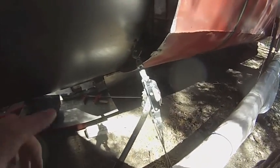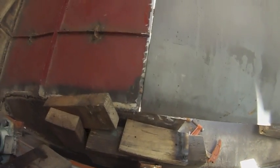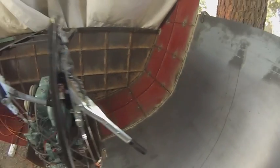I have a tack weld here to start. In the end I'm resorting to the winch, hoping it will stay on that tab over there. Took about an hour to get to this point. I've got a nice flush fit right there. I'll weld that and just keep pulling a little bit more as I go. This outside line is the line I traced with the stick. This inside line is the one I'm going to cut. It gets more and more away from that line as it goes up — this is 85mm at the top. The reason is I want the stern to curve in so that when the waves hit it, it's just that much stronger because it's got a little arc to resist with.